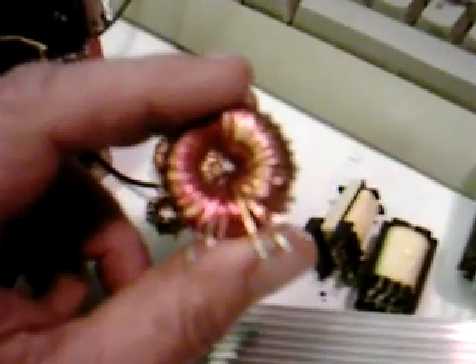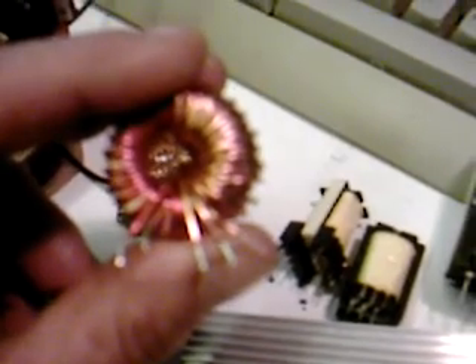Where I'm headed for is these toroids — they really are going to help us quite a bit. I'm going to bring the switching frequency up on this supply to probably maybe two to five kilohertz, and then go on up maybe as far as 20 kilohertz and see what our efficiencies look like.